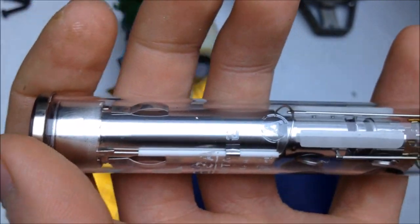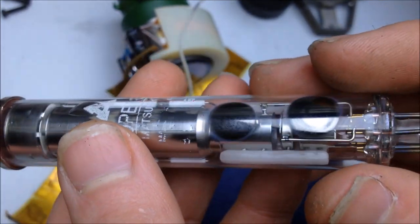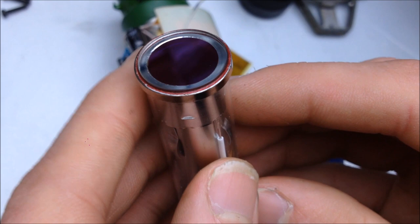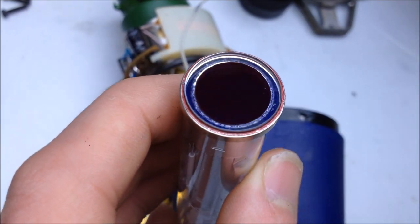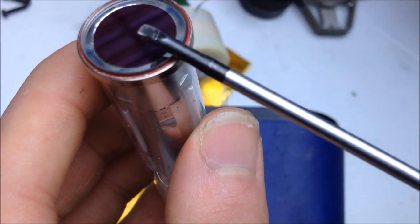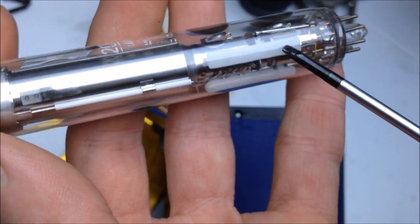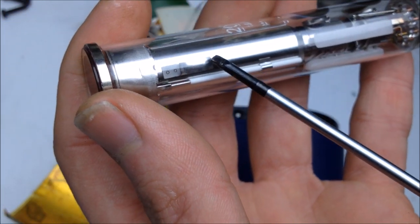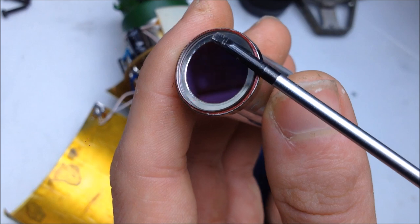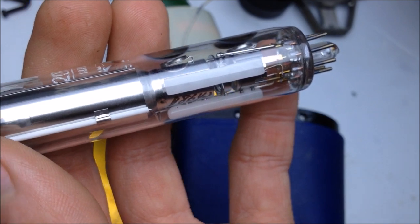Let's take a look at both a CRT tube and a Vidicon tube real quick. So here I have a Vidicon tube, and this is what they used in video recorders before they had the CCD chips, the charge-coupled devices. And it has the same photocathode right here on the top, which is the positively charged region. It has bounced electrons back. And then you have your heated cathode. So what this does is it would shoot the electron gun up, and the areas it had a charge on here would deflect the electrons back, and they would be picked up as an electrical signal.